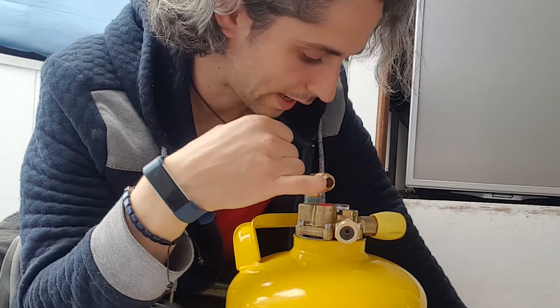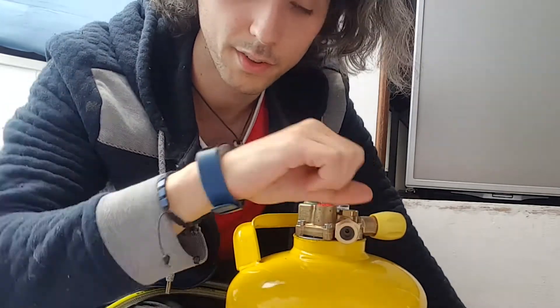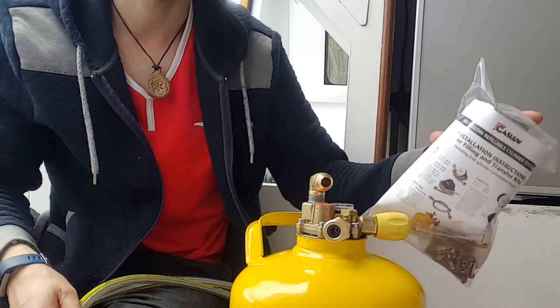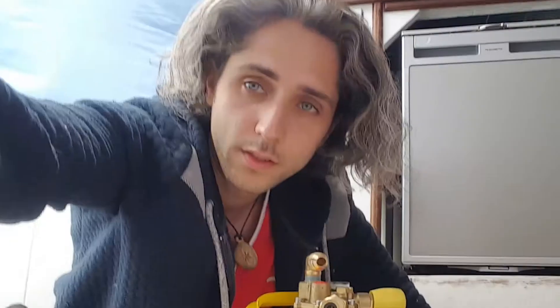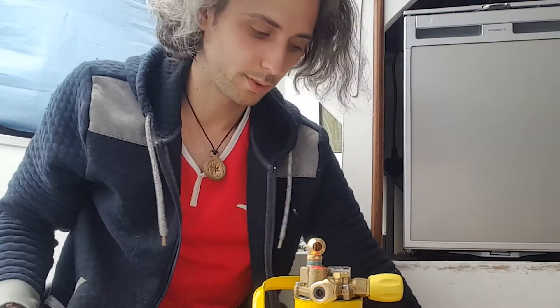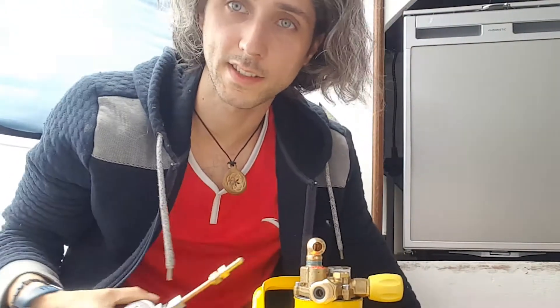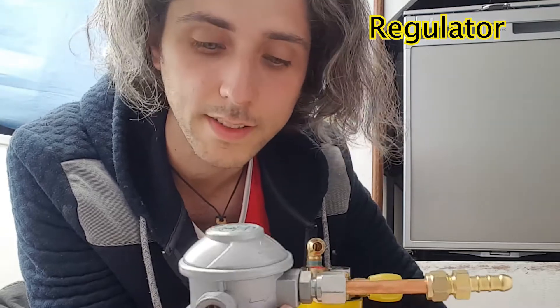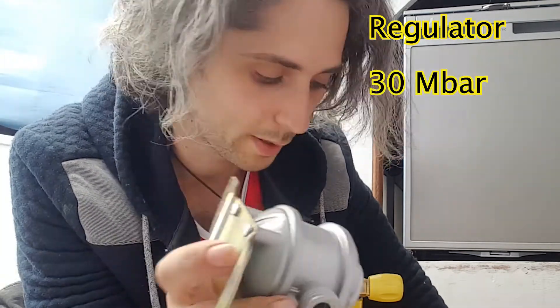With this can you can have an internal filler point — just get a direct piece that fits on here, plug the gas on, take your can out, fill it, and you don't need the special hose and kit, which costs about 80 pounds itself. If you don't need to spend that money, don't. W20 fittings go on to most appliances — they just screw on and have eight millimeter bayonet nipples. You also need a regulator — this one is a 30 millibar regulator.